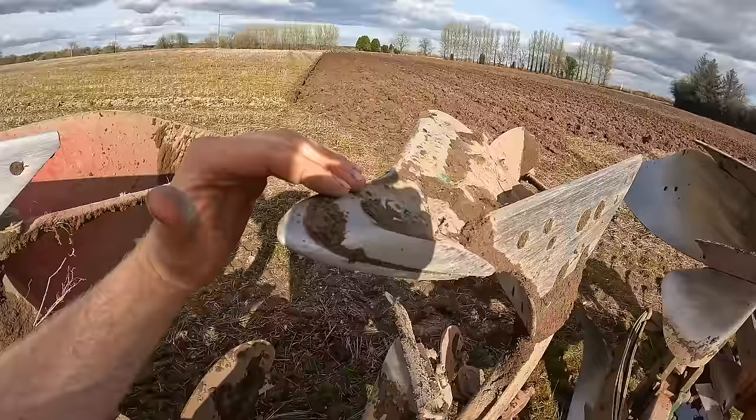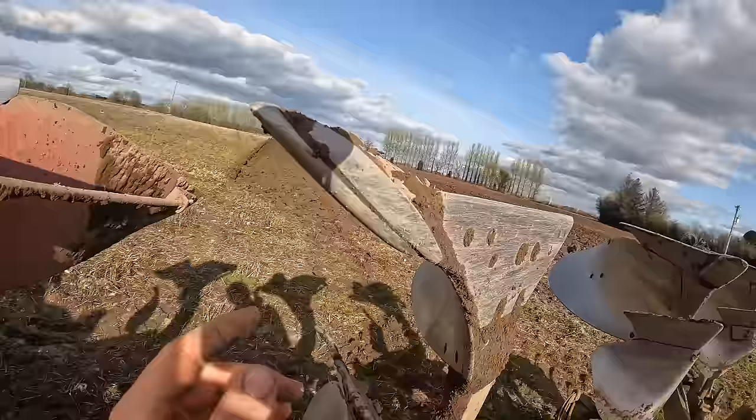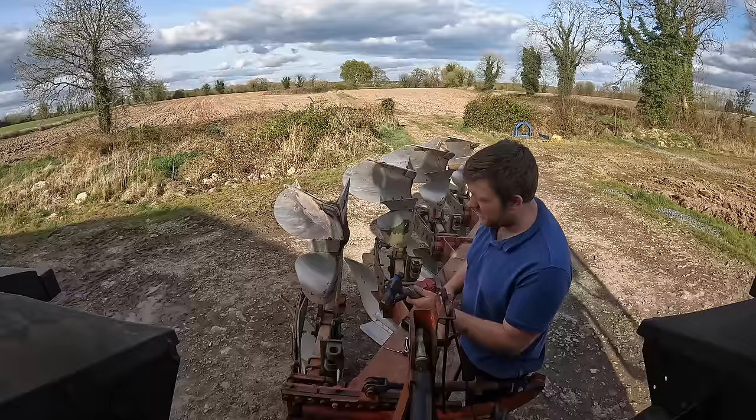So I'm going to turn the points, because the point is double sided. There's a new end there. So it's just bolt it off, turn around, bolt it back on. The Jeep is in the yard and it has the big gun in it and all the sockets. So I'll just tip in and we'll go change the points. Biggest thing when doing this job is don't use your finger, keep the bolt up, it'll cut the hands off you. Use something that won't.